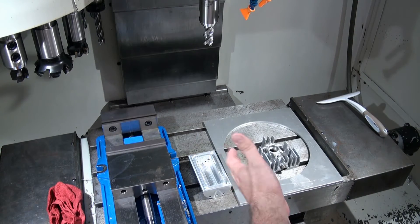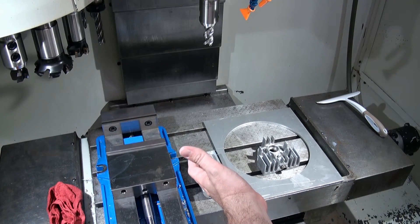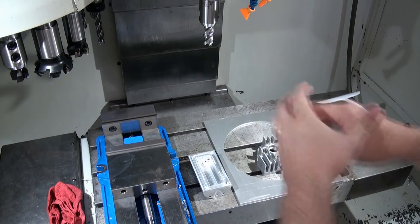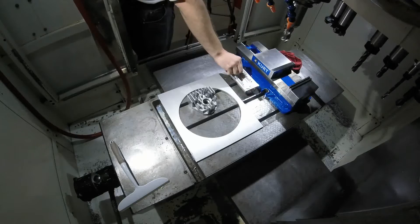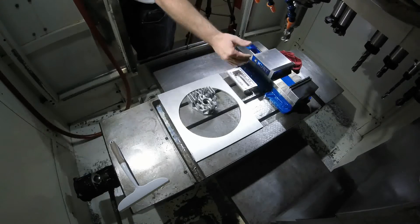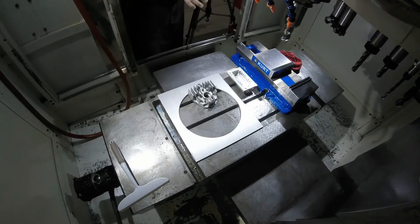The Z's range anywhere from 10 inches up to 15, 16, 17 inches. So you have to make sure that your part will be able to fit within that work envelope. This part here is one I make for myself — this would fit within the 8-inch Y envelope, same thing with this part here. So those would be okay to make.